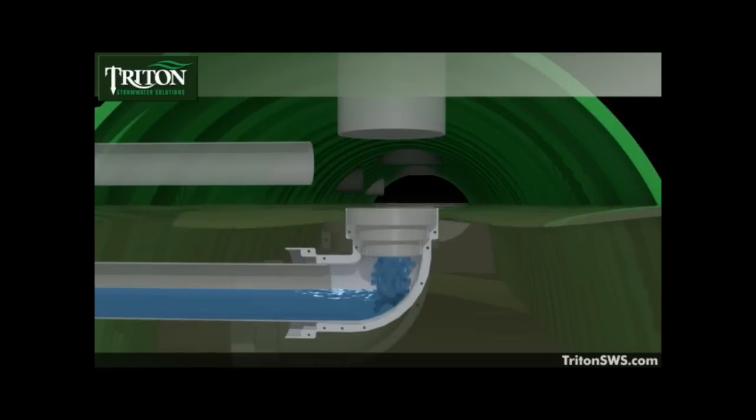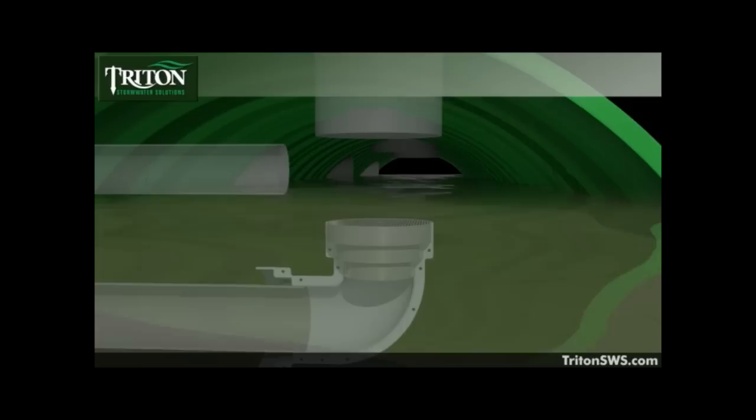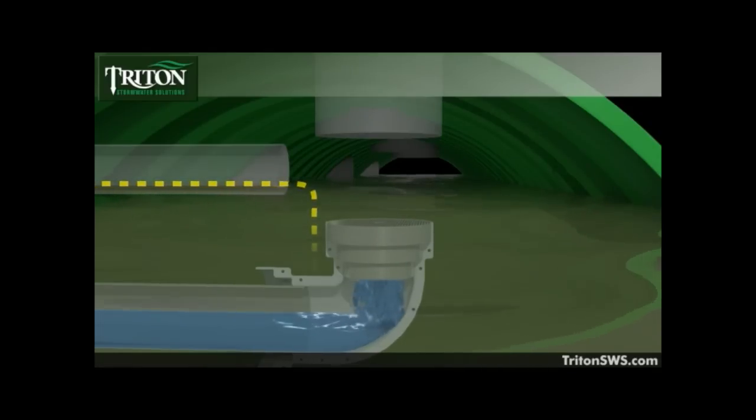The result is that cleaner water is stored, leaving less sediment and fewer contaminants to leach out in the infiltration process. In the case of a first flush that threatens to flood the site, water bypasses the filter elbow and puck and is passed directly via the overflow pipe to the storage chambers to protect the development and prevent water from running off the site and entering civic stormwater sewers.